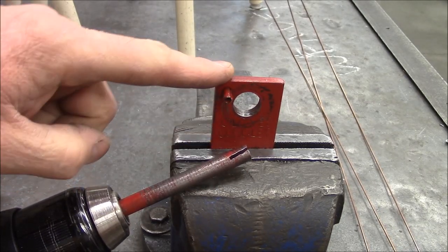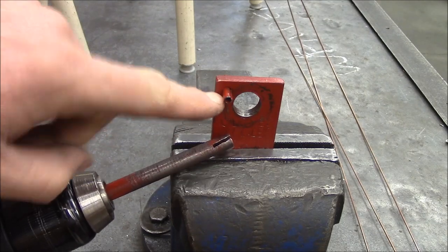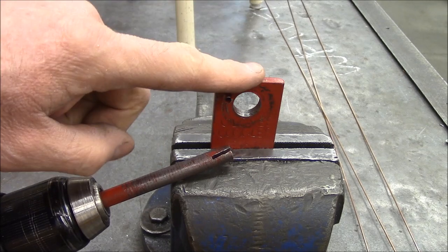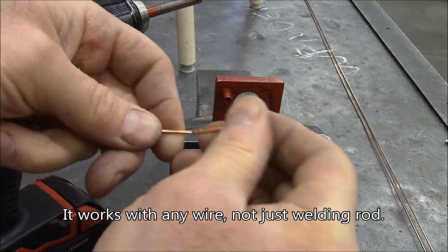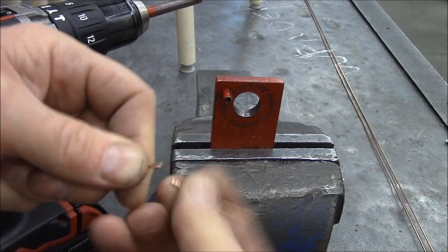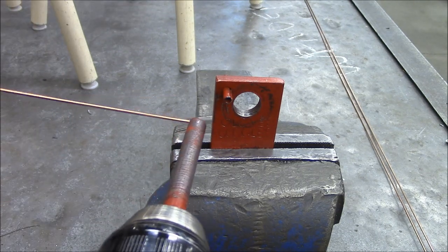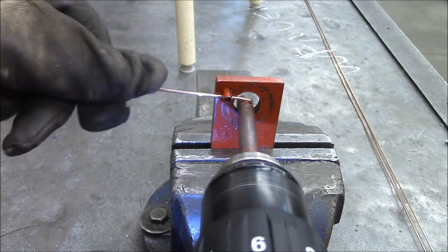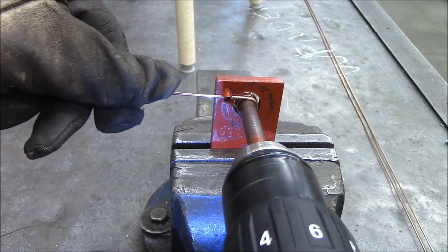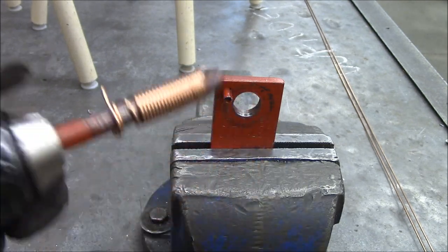I also made this design, which no kids seem to be able to use. It's just a piece of, looks like 1.5 by 1/4, with maybe a 3/16 roll pin, some 3/8 rod with a slot cut with a hacksaw. And in this case, I would use just welding rod, whether it's gas or TIG rod. You're going to break off the swedged end with the numbers because we don't really need that. I'm going to wear a glove just because I'm a little chicken. And I set this through here like so. And I put this in the hole like this. And then put this on a slow speed and just give her one of these. But no kids seem to be able to do this one. It just buggers it completely. But that's how I'd make these.